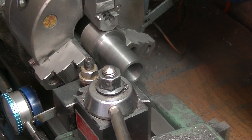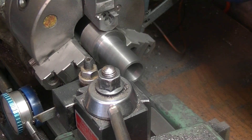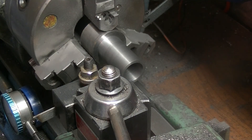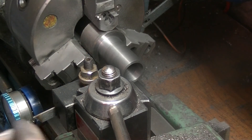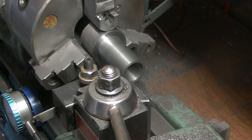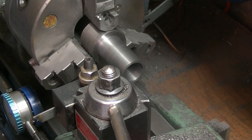Next, we need to go over the thickness of one of these rings, which I believe is a sixteenth. These are all sixteenths. So we're going to go over a little less — 60 thousandths. Now we're going to lock the carriage.